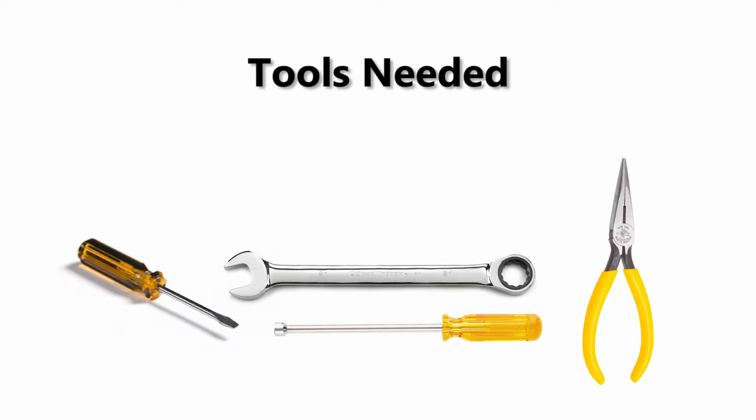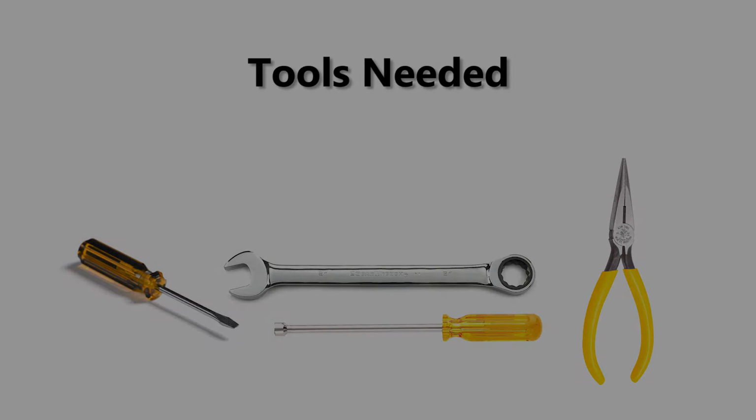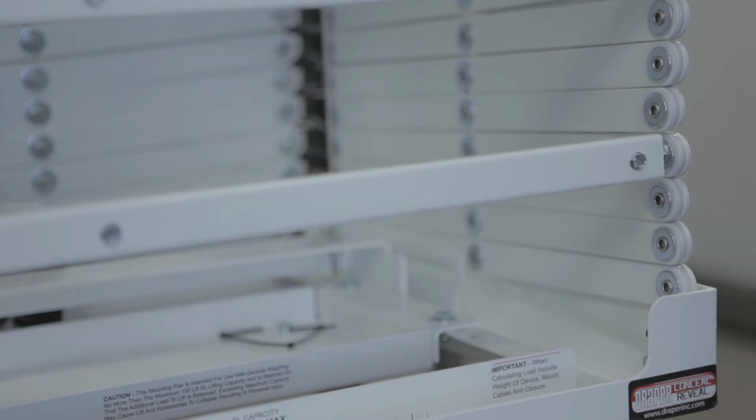It is recommended to have factory supplied switches installed, access to disconnect the lift power, and safe access to the top pan from the front of the lift. Problem: the scissor lift only moves about an inch at a time and then stops. This occurs when moving either up or down.